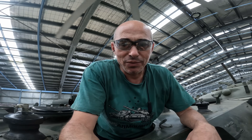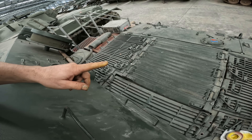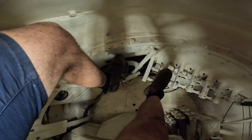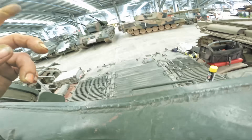The job today is to identify which magneto is at fault and to try and work out what needs to be done to troubleshoot and fix it. So somewhere under here is going to be the magnetos and timing marks for the engine. Down inside the fighting compartment there's also going to be an access point to rotate the engine by hand so I can check the timing of the magneto. The first thing I'm going to do is attempt to start the engine up and try to identify which one is the faulty magneto.